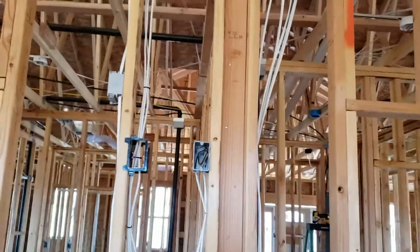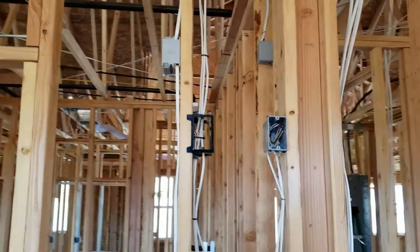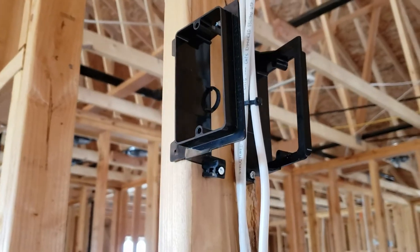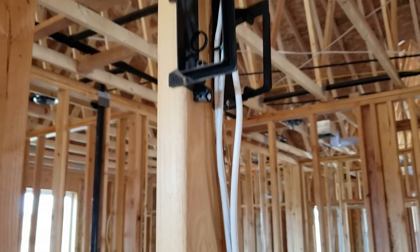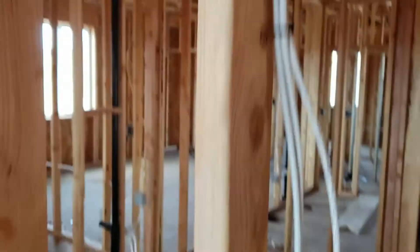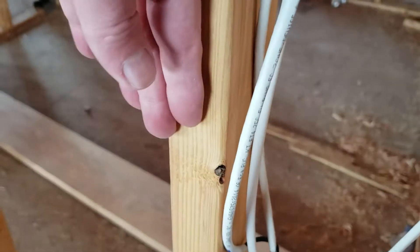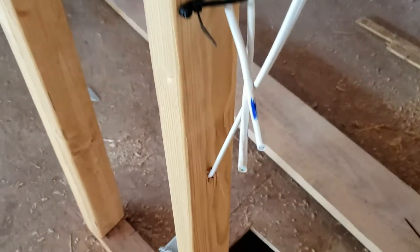In this room — the master bedroom — we're putting a 43-inch Samsung The Frame TV on this wall. Notice I've got two low-voltage boxes here. On the other side of this wall is a walk-in closet where there'll be a shelf, and the control box for the Samsung TV will be located there. So I put these boxes here for a straight pass-through. Notice how I've got the cables zip-tied along here with a loose zip tie down here to help keep the cable in the wall so the sheetrockers don't pinch it. There's the color code — blue.